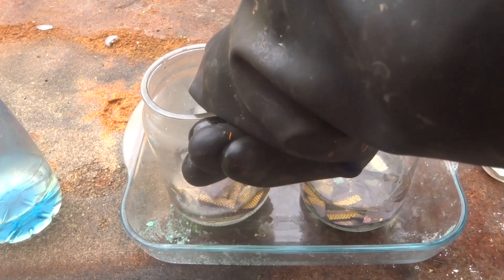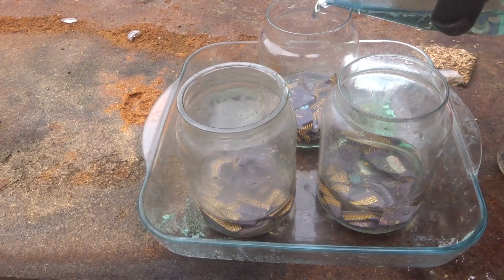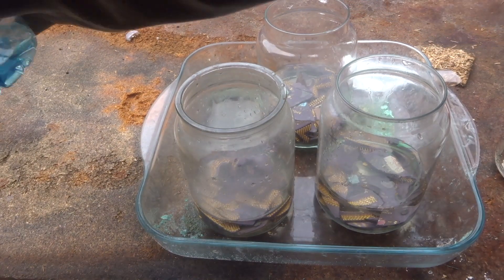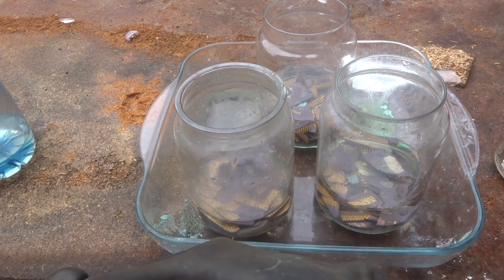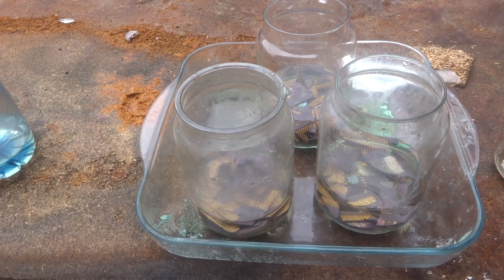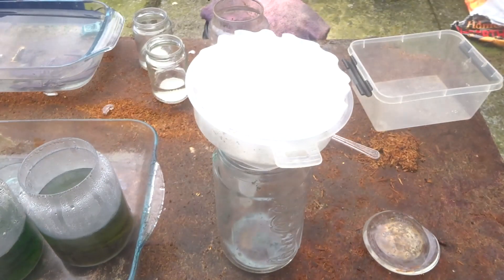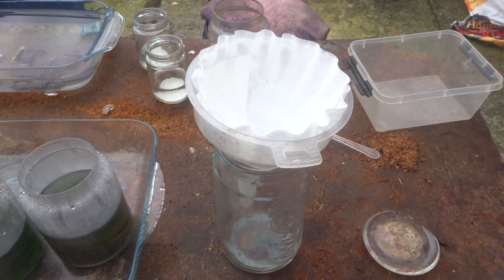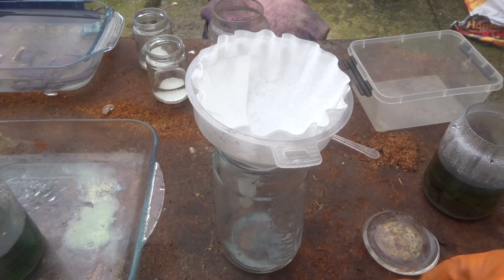They're just covered - you can see a little bit of fuming coming off the top of them. That's why you wear gloves - nitric spilled here, so if I didn't have the gloves on that would have been on my hands. Very important. So I'm just leaving them in pure nitric, you can see the fumes coming off it. This one needs a small bit more. Okay, so I'm going to leave that and let it work away and we'll come back in a couple of hours and see how it has progressed.